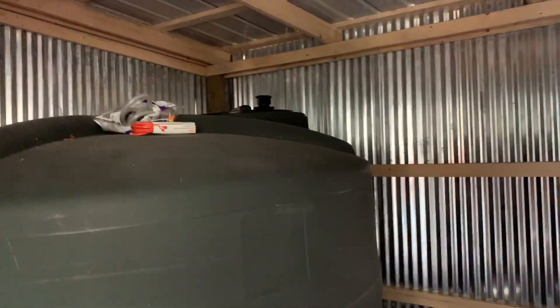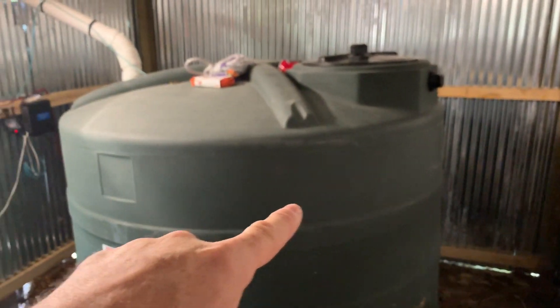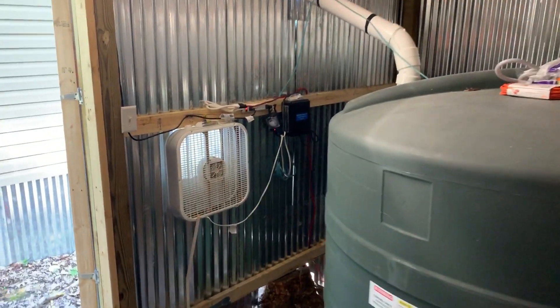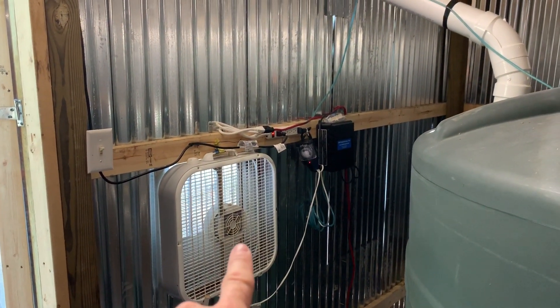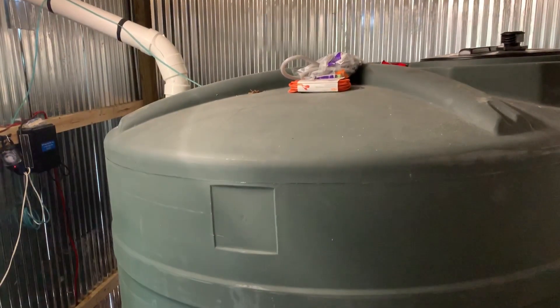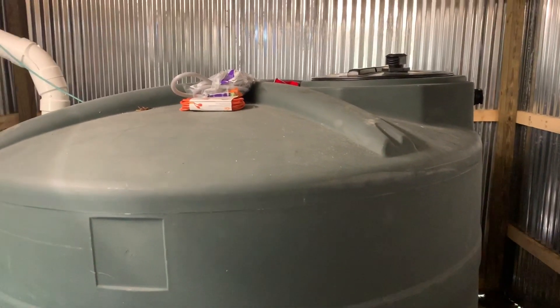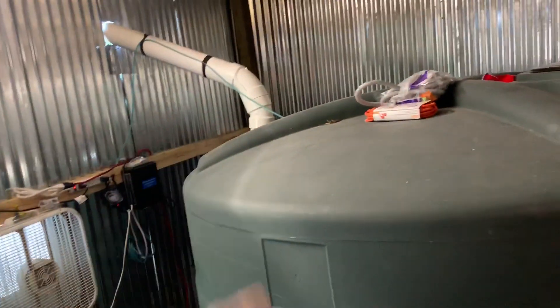This is my tank room. Water comes in here — I've got a 1600-gallon tank and it's probably about 1200 gallons right now. Over here I have what they call an ozone generator. You can see the hose coming up and going inside. Three hours a day, a fan and the ozone generator come on with a bubbler, like in a fish tank, and it bubbles ozone inside the tank to kill any bad things. There's no algae because it's a dark-colored tank inside here, but anything that gets in will be killed by the ozone.